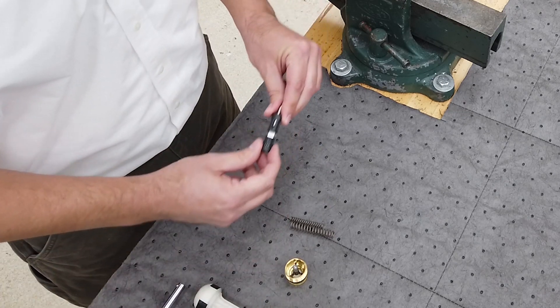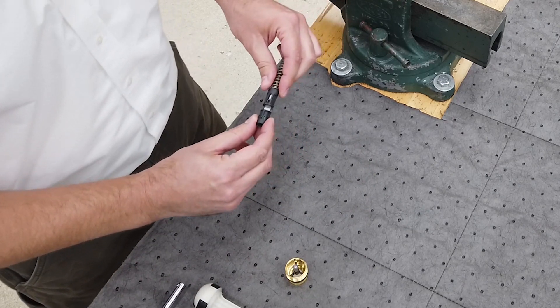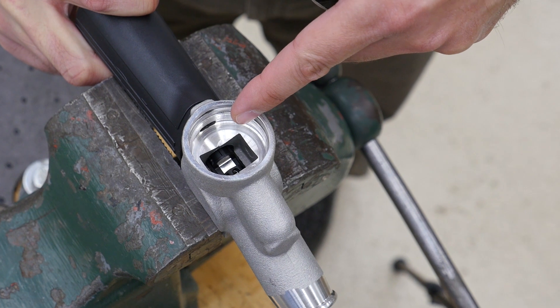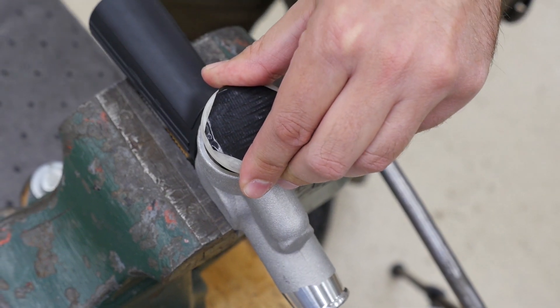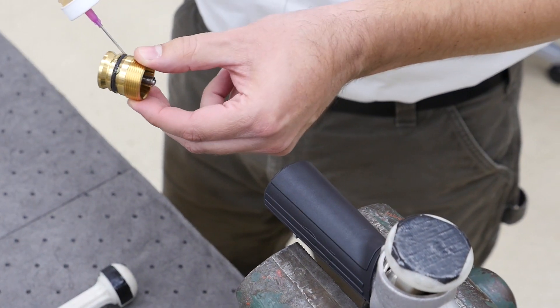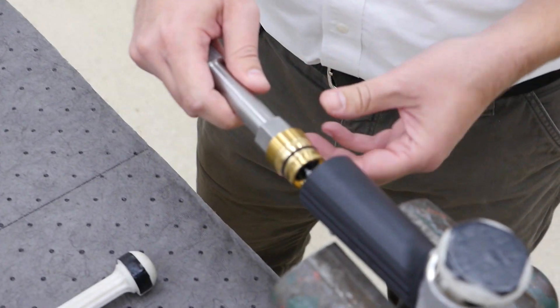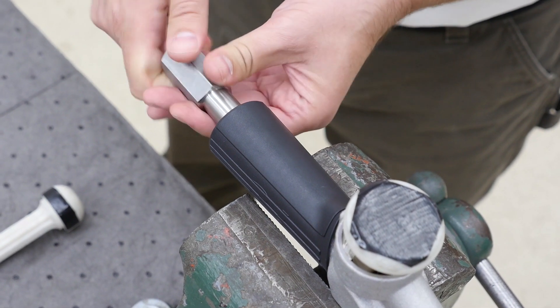Using a light assembly oil, lubricate the o-ring. Next, slide on the smaller spring followed by the outer spring. Insert the stem assembly into the nozzle body. Using the stem hand press, push in the stem assembly until you can see the groove whilst looking down into the diaphragm opening. Place the stem stop block into the diaphragm opening and into the groove, then slowly release the stem hand press leaving the block in the groove. Lubricate the o-ring on the valve assembly and install it into the nozzle body. Using the T-handle wrench, tighten it until it is snug and remove the stem stop block.